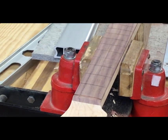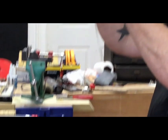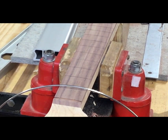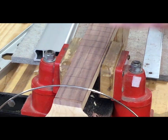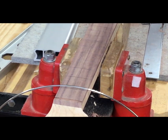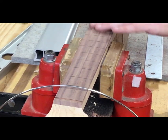I'm going to bend this out just a tad bit — I want it over-bent past the 12 radius. It's recommended that when you put your fret wire in, you have an over-radius. I don't know exactly how much — I just over-radius a little bit. Because when hammering or pressing that fret in, when you press the center down, those barbs that went in are going to slide over just a tad bit — it helps lock it into the slot. If you notice old Fenders, they don't have much issue with frets coming up on the side of their fingerboards.